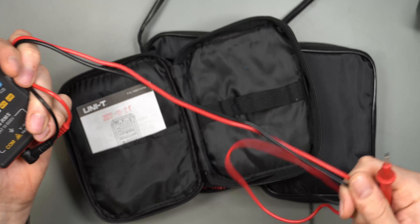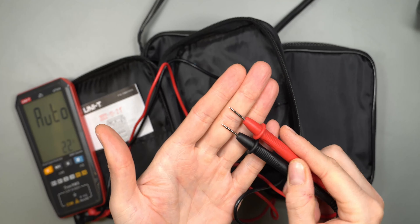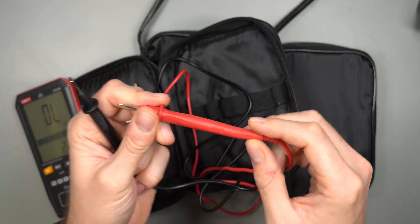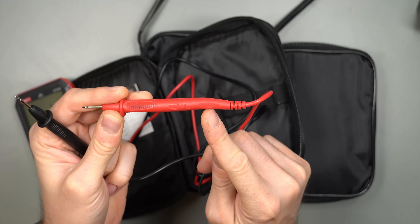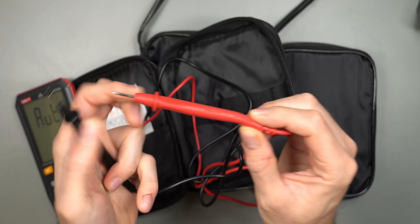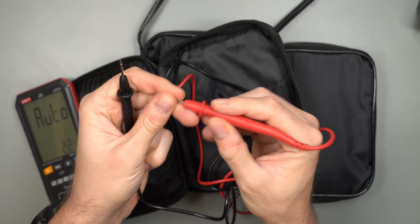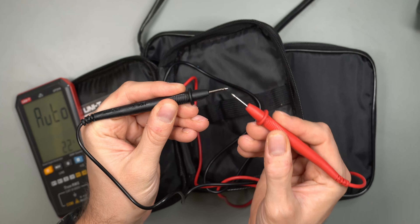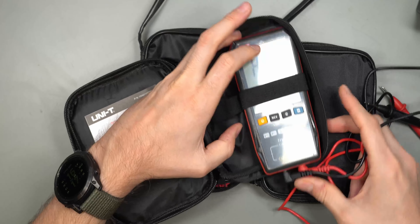The test probes have fairly flexible cables — I believe PVC, not silicone, but still flexible enough. The other end has standard test probes, no gold plating. There is UNI-T branding and a Category 2, 1000V rating. One of mine was a little crooked at the end, bent a bit in transit. The ergonomics are pretty good even if connectivity isn't ideal due to the lack of gold plating. There's also a little elastic band to strap the multimeter in place inside the bag.